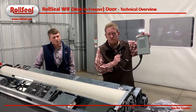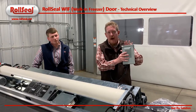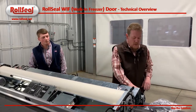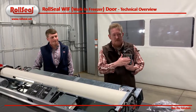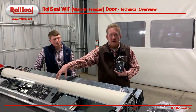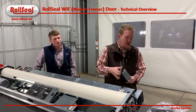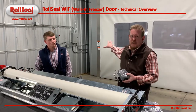Kind of to continue with the ease of installation conversation — all the doors will also ship with a true lockout/tagout box. This is the only place that an electrician will bring power to the door. You've got your quick disconnect that goes directly into the door, so you're just bringing power right here. That'll ship standard pre-wired with every door. Another change with this door is our internal switch now takes the form of a wave switch. All the inside switches for the door are now touchless, in addition to your motion sensor that you have outside. It ships with enough wire to mount it pretty much directly behind the track, but we also send it with some additional cable if you need to mount it a different distance away from the door.